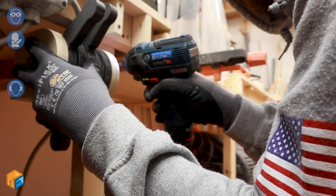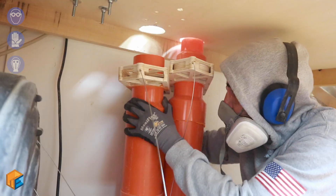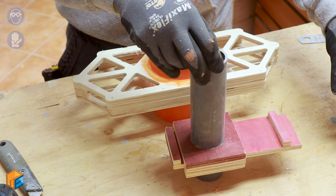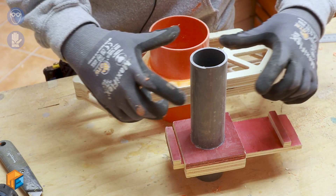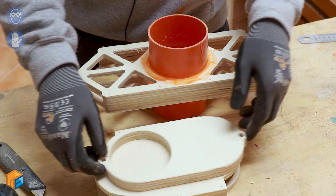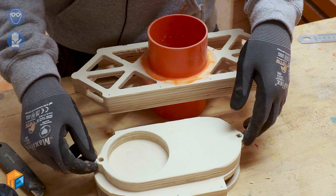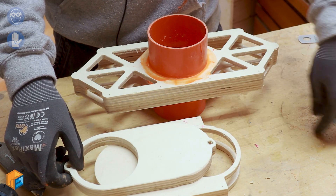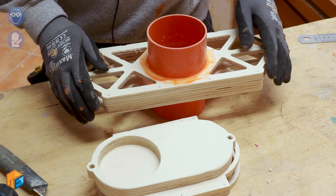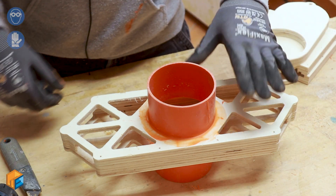Last step: fasten the levers, add the blast gates, and connect the gates to the levers. But first I want to critique my own design — this blast gate looks huge, at least it seems huge. This is the old gate for comparison; of course the old one has a smaller diameter. Comparing my new design with a classic blast gate of the same diameter: when you open a classic gate the piece moves out and comes back inside the valve, so it might seem more compact — but you're not looking four-dimensionally. The space next to it must be empty to allow the gate to open and close.